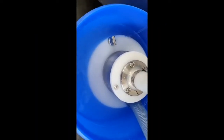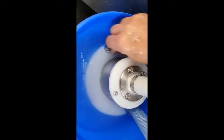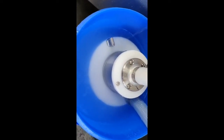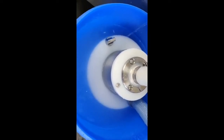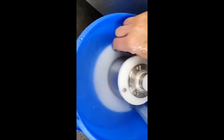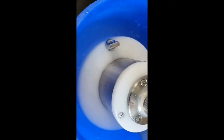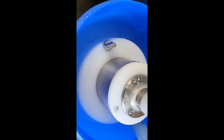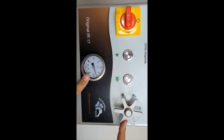This shows the pump. You can see position 0, position 1, and position 2. Position 0 is where we are mainly just sucking in the brine. Position 1 means we are maintaining the mixing of the brine — keeping it mixed as it is. If you switch to position 2, the machine is now actively mixing the brine. As a rule of thumb for daily use, operate the machine on position 1, then regulate all other settings through the stirring wheel to adjust the pressure you need.